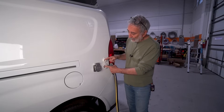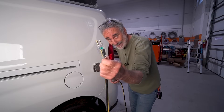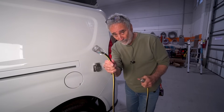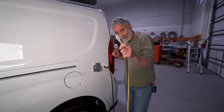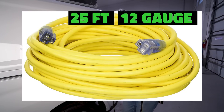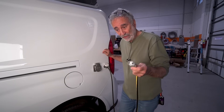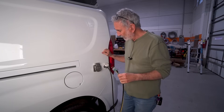There is a male 120-volt AC plug inside that little cup. What you do is plug your female into that male, and then this side is just a good extension cord. Use a 12 AWG, 12-gauge extension cord for 20 amps - not 14, not 16. Get a 12-gauge AWG.